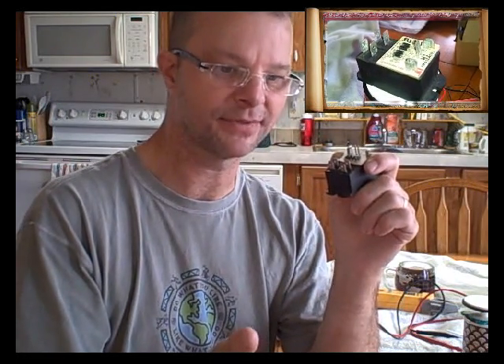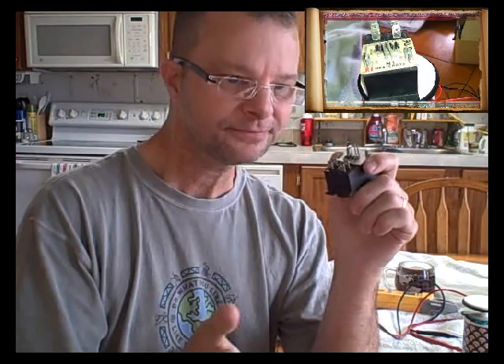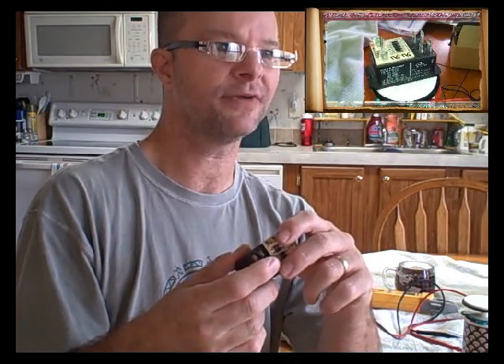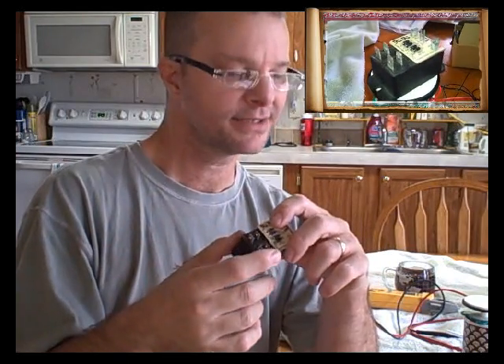So I thought, let's try something different — let's just get the heat pump to come on without the heat strips and see what happens. I bumped it up one or two degrees. Usually heat pumps are safe at two degrees without the heat strips coming on. I did that and it worked fine. I let it run, bumped it up a little more — no problem at all.